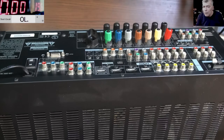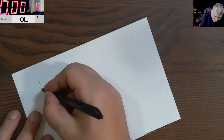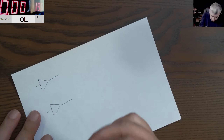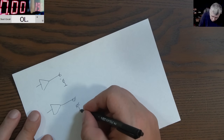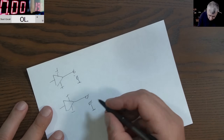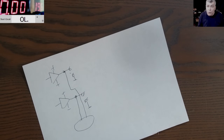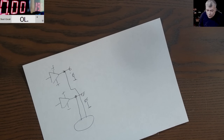Let's quickly cover how amplifiers work. You have an amplifier with input and output, and the speaker is connected to ground. From the amplifier you have plus and minus — a differential power supply. The outputs are monitored for voltage; if you have voltage on the output, you'll burn the speaker. That's what the protection is about — you only have a protection light or LED indicating the fault.